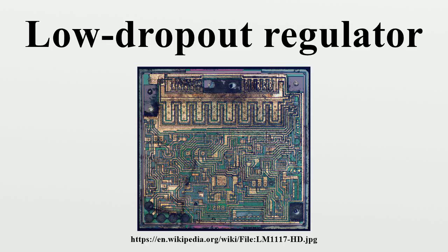Most LDOs have relatively high PSRR at lower frequencies. However, a performance LDO is distinguished in having high PSRR over a broad frequency spectrum. Having high PSRR over a wide band allows the LDO to reject high-frequency noise like that arising from a switcher. Similar to other specifications, PSRR fluctuates over frequency, temperature, current, output voltage, and the voltage differential.